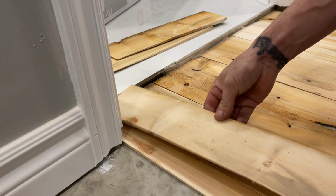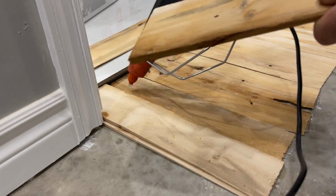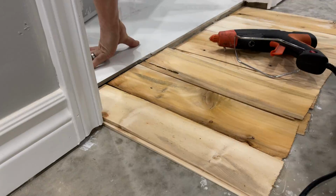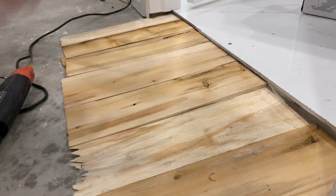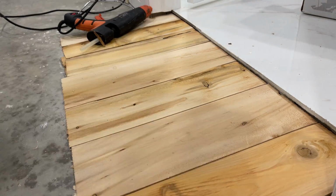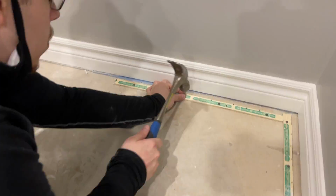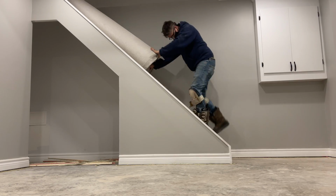But this is what's necessary when you have a contractor come in and doesn't do a proper job with the tiles. And they kind of stick it to the carpet guy to fix it. That should have been down right to the ground on the concrete with a J-mold on the edge, but it wasn't, so we fixed it. And there is Rob bringing down the 10 mil gold underpad.